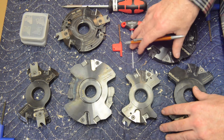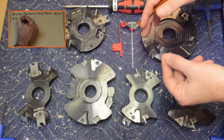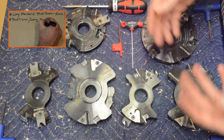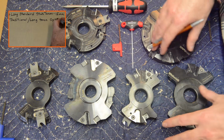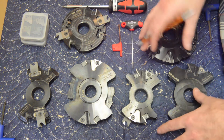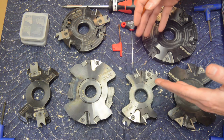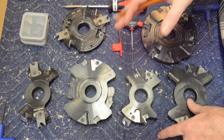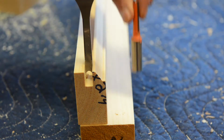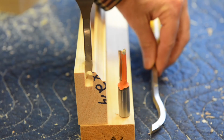But you can configure this set to make around 45mm tenons if you want. So this significantly increases the glue surface area for larger doors, or if you just want to do higher end work with longer tenons and smaller doors. It also opens the opportunity for pegging your tenons if you want. Now remember how I said this set was adjustable for tenon and groove width? Well, this allows you to dial in the width that perfectly suits your tooling of choice for mortising, be that hollow chisel mortiser, chain mortiser, router bits, or old-fashioned mortising chisels.